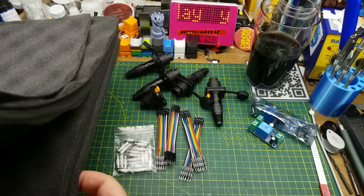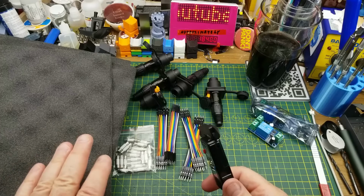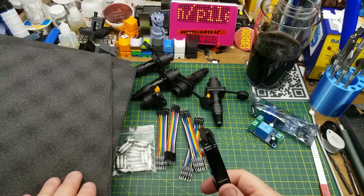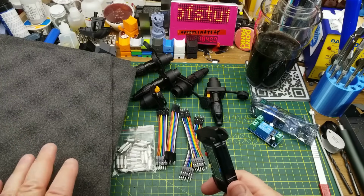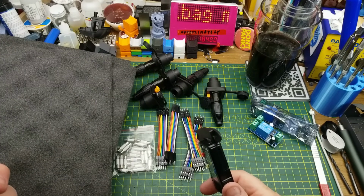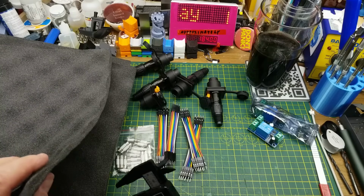And then there is this acoustic foam. There's 2 different kinds of acoustic treatment you can do. One of them is echo reduction, which is what this is. Basically just softening up the hard surfaces so audio doesn't bounce off them. These are less effective for the other type, which is sound transmission, basically reducing outside noise coming into your environment. Things like dogs barking on the street, or as you may have heard earlier, an air conditioner running or a sump pump running or something like that.